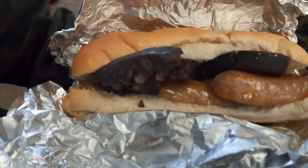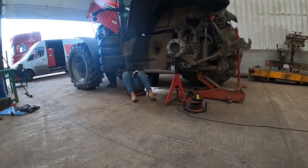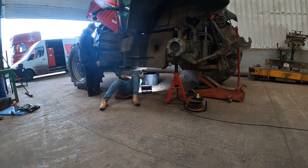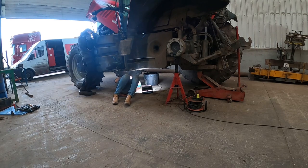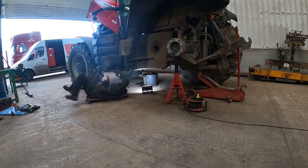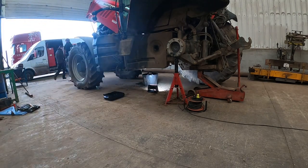Butty time now - Jack's applying the goods. Very good customers, these, keeping me fed and watered. Just about to take the diesel tank off now. It's got a saddle tank on the other side so it's got two tanks, one at both sides. Even though we've drained all the diesel out, you can't get everything out, so when you slack the pipe off at the bottom to pull the tank off you normally get about a good bucket of diesel come out. Unfortunately all the soil and rubbish drops into the bucket too, so it's normally no good after it's been contaminated - not worth the risk tipping it back in.